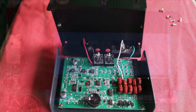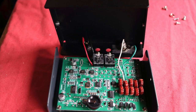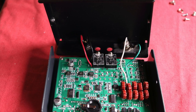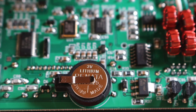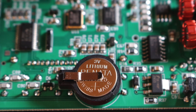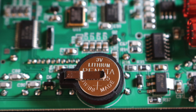The circuit board mounts directly to the front case using four screws, one in each corner, which screw into the spacing posts on the PCB. To solder the cables to the BNC and power socket you need to get both parts of the case very close together as the cables are quite short. The MTR-5B can be fitted with a button battery to power the real-time clock and retain settings when the radio is off. It wasn't immediately obvious which way the battery goes, but this is now clarified in the Kanga guide — the sprung arm on the battery holder should have a positive symbol. The battery is installed with the positive side facing upwards.